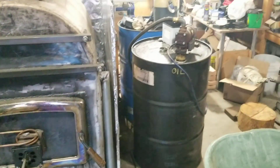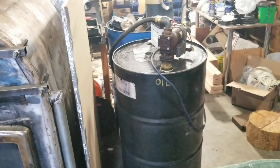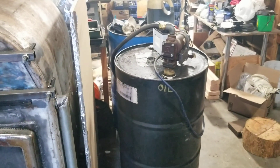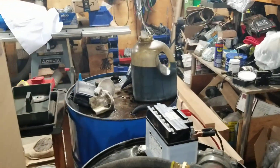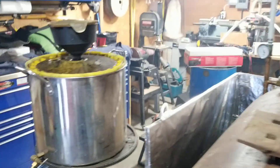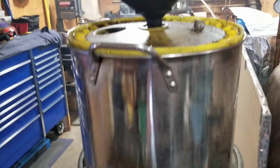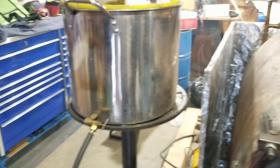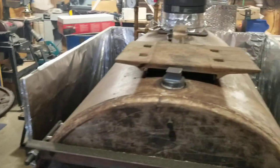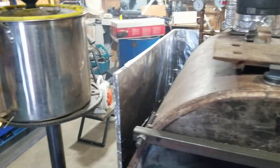The only filtration I do is I keep it warm inside, because you have to heat the oil in order for it to burn atomized properly. I just pump it into a jug, dump it through my paint strainer and filter, five liters at a time, and fill up the pot. If I need to heat it up quickly, I can sit it on the plate on top of the stove — that'll warm up a lot faster.